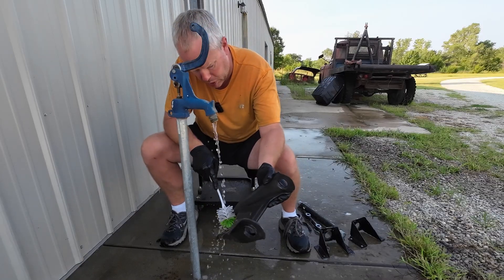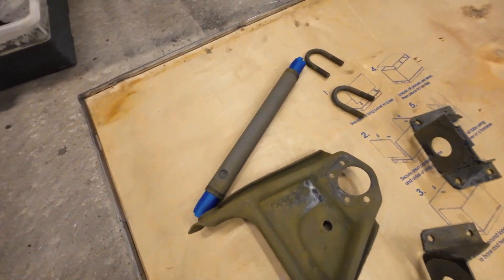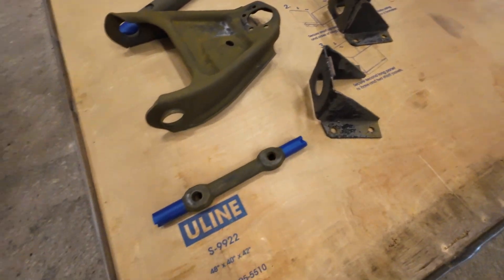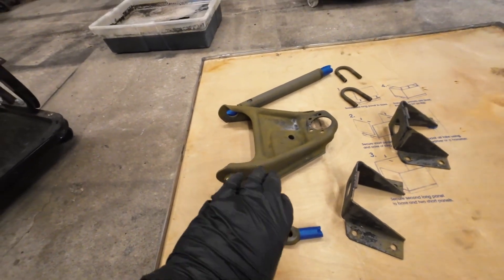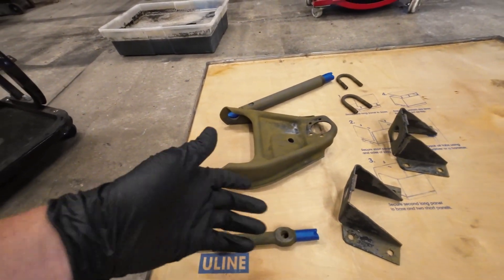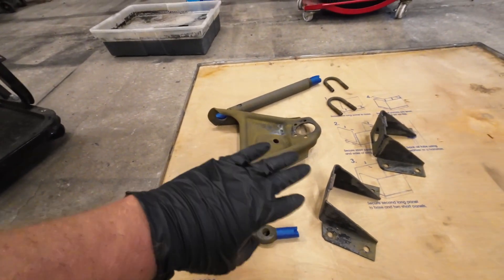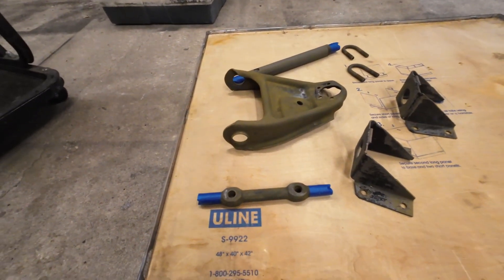This thing is just perfect. Here's what we end up with afterwards. I got everything blown off and taped off what I don't want painted — really, really clean. If you do get a tiny bit of flash rust, remember that rust is a little different than what came off before. You can just wipe it off with a blue cloth or something. At this point, let's get to painting.